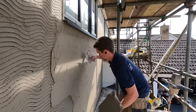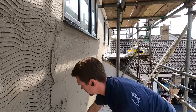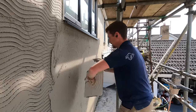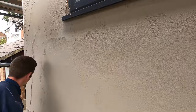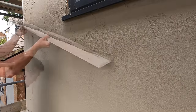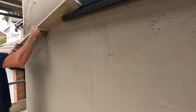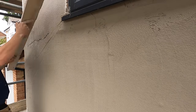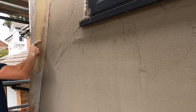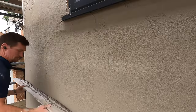It's also a more flexible product — it's not actually sand; I think it's a polymer render, which means it's got a lot more flexibility than sand cement. It's still cement based, so it's the same idea, but it's a totally different way of making it. As you can see it just rules really easily, it doesn't sag, it doesn't pull — you just rule it as if it were an internal plastering product, and these little distinctions make a massive difference when you're rendering.